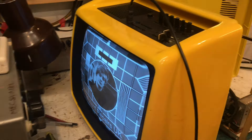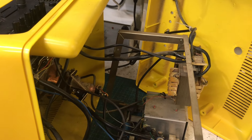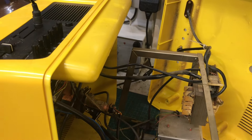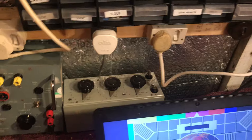So that took far more longer than I thought it would. HT is adjusted. I've got a couple of caps to change — crappy ESR. I've done the main smoothing cap already. I'll show you the one I took out first — I've cleaned it up, tested it and it's not very good, so I've replaced it. Slightly higher voltage rating on the new one of course, but that's what we've put in there.